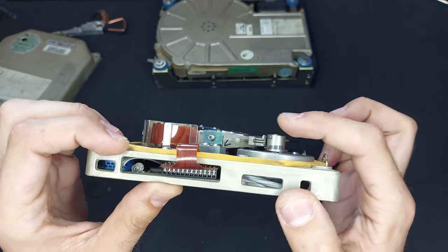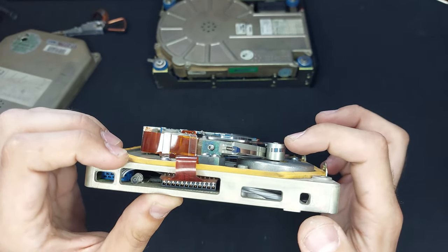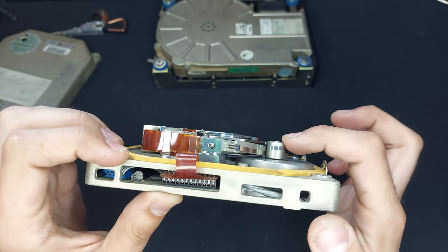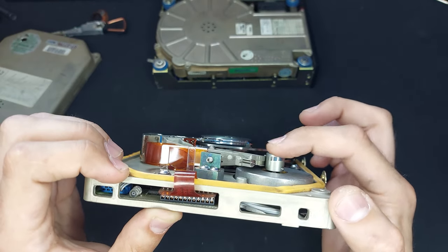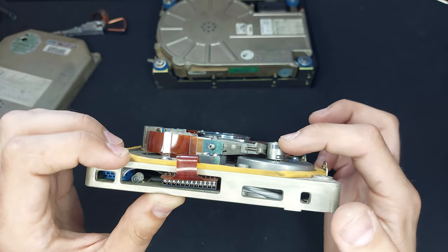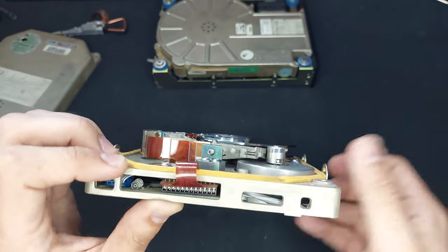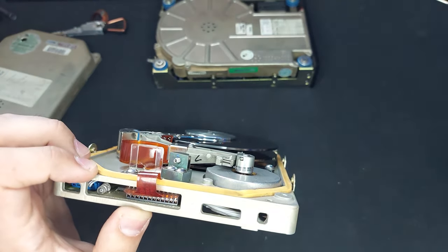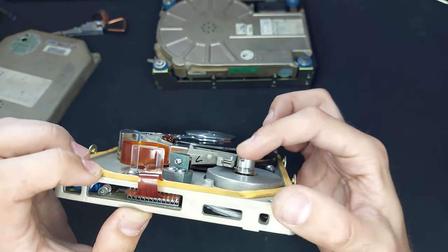The very interesting thing about this hard drive is the way they've implemented the motion. You can't afford any backlash. So what they did is wrap a tape of metal around the cylinder here. When the stepper moves, it's like one of those card tricks with the tape that moves from one side to the other. There is no backlash in something like this. This is how some surface grinders' wheel tables move from side to side. It's a very low cost and very reliable way of getting zero backlash.